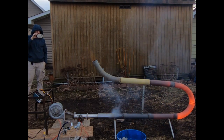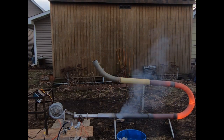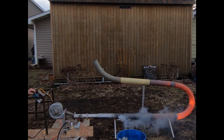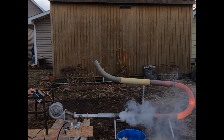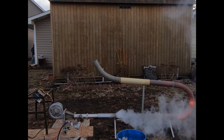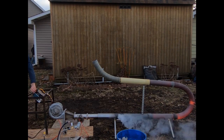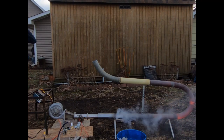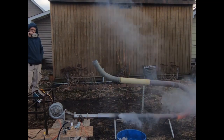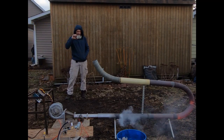The only reason it isn't doing it 100% here is because of laminar flow and all that. But nonetheless, this equipment with the proper nozzle is going to fit the bill. This is a 1.5-gallon-per-hour nozzle, which is way under par. We had to get up to like 1,000 PSI to get this thing to run right, and we ended up blowing an oil line doing that — a stainless steel braided hose. So we're going to try this test again with a 2.5 B-cone 80-degree nozzle probably in the next day or two, and I'm also going to be trying it on a 4-gallon-per-hour nozzle as well so that we can bring those pressures down a little bit. But for the most part, I'm pleased with the test. The test apparatus has a couple holes in it here and there, but I'm not really worried about that. This thing was just the check: A — will the ignition system work? And B — will the thing burn at all? And we pretty much figured that out. So I'm calling it a day.